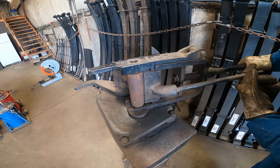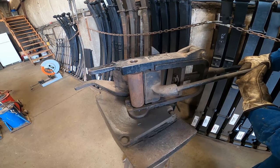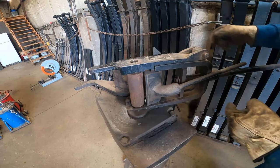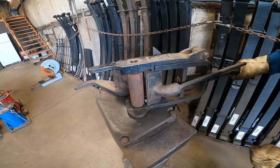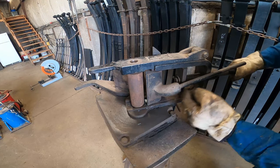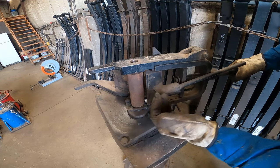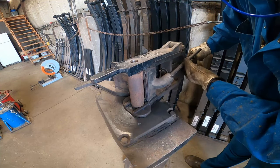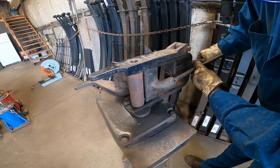On this side here we have an arm that will clamp onto the material, and then I can swing this whole arm around — that's what actually rolls the eye. It's adjustable as well with the handle here. It's all threaded in here so you can roll this in and out, and that will adjust the teeth in here to determine the gap in this area so that when I open it up and grab ahold of the piece of material, it's set to the right depth.